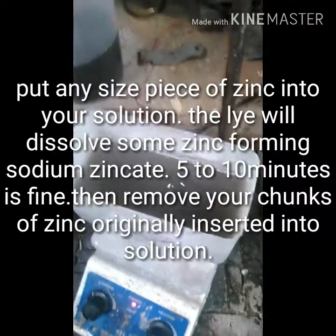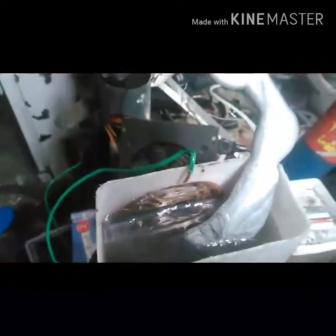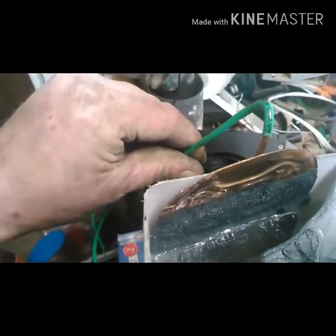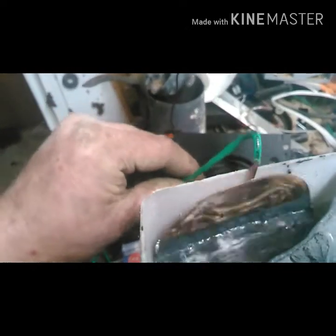You can see in here, this is where I'm at right now. So now with your container and your solution, you're going to want to get a DC power supply. With that, you're going to want to get a cathode and anode set up and put into solution. Your anode, you're going to want to have a piece of zinc. And your cathode, being the negative terminal, you're going to want either a piece of copper or zinc — both will work. I'm using a copper cathode and a zinc anode. And as you can see, it is transferring the zinc metal from one to the other, this being the negative.